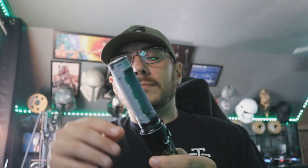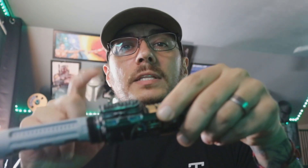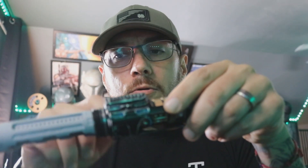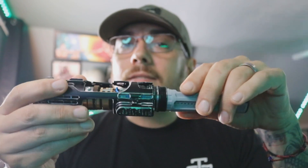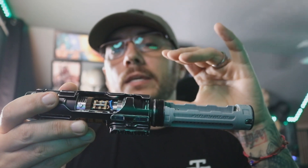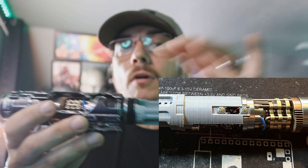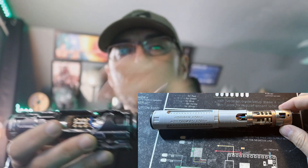There are two different ways to lock this chassis down. There is a nice chassis retention screw located under the shroud — when you take the shroud off, which you'll have to do to install it, you'll find a button head screw that is specifically there for chassis retention. One thing very interesting and very nice about this saber is that you can take this crystal chamber out and do all of the install with the crystal chamber and the chassis together. You don't need the main piece, you don't need all the shrouds. You can do all that together, and then when you're done, you simply put it together. That's something that's very different from the Gen 1.